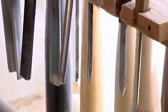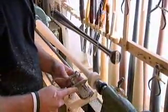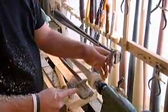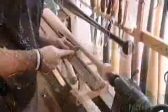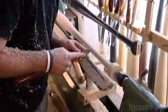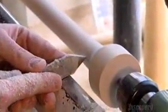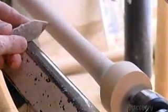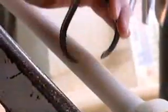Now he takes a turning tool called a skew chisel. With its pointed tip, he cuts into the bat's handle just above the knob to narrow the shoulder. Again, he measures as he cuts to make sure the diameter is just right. Using the skew chisel, he shapes the slope of the bat, repeatedly checking with the caliper to make sure it meets specifications.